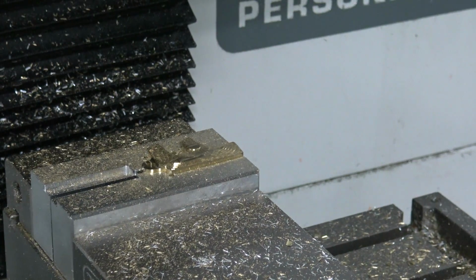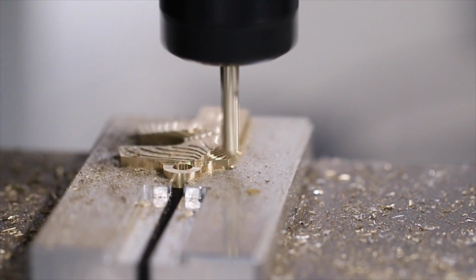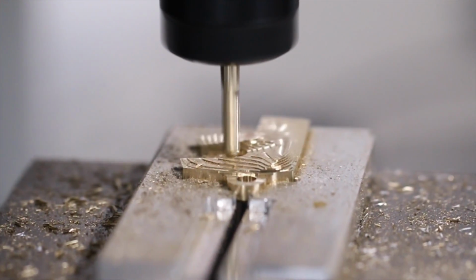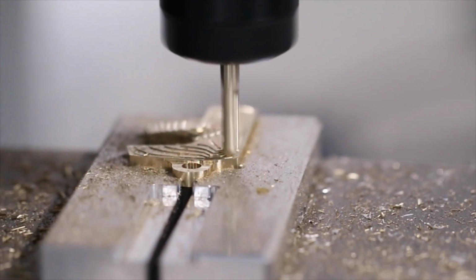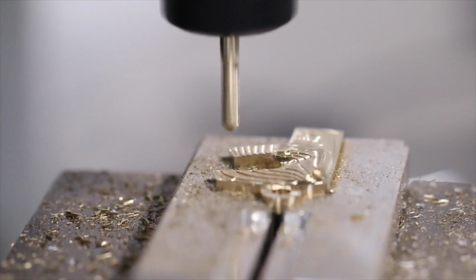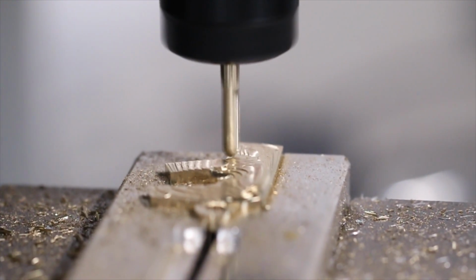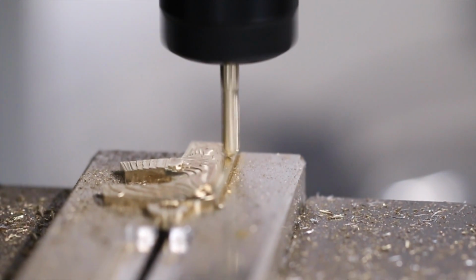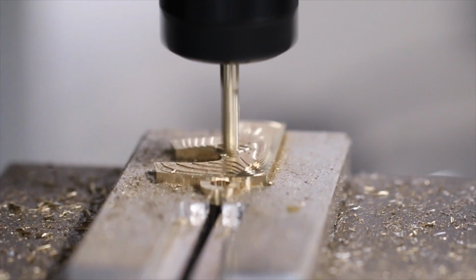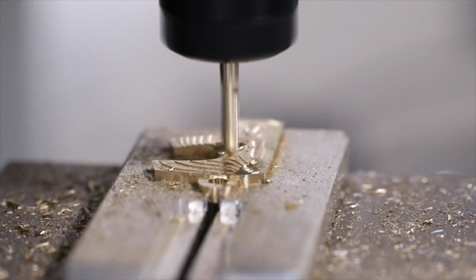Okay, 3/16 ball end mill. Let's do some surfacing here. Like I said, first thing I'm noticing is there are some air movements. I'll take a look at the tool path. Well, we'll do it together and see. I suspect I can clean that cutting up, unless I'm misunderstanding and this is an adaptive. Sometimes we'll do an adaptive at a slower feed rate before we go in and do a real fine step over to get the finish. I just went and looked. That's exactly what it is, which is awesome.